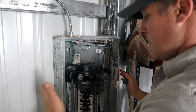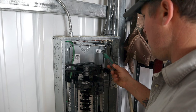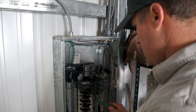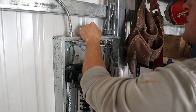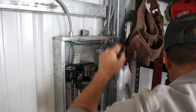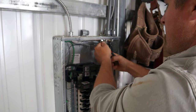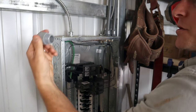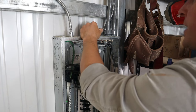So we got the panel cover off and the power turned off at our main box. We're just going to test it now to make sure we have no power in this at all. Appears we are good. I want my conduit running up about right here so it clears this little beam. These little pieces in here — you can get some pliers and just punch them out with a hammer or twist them with a screwdriver. These little covers come out and then you can slide your corresponding coupler right into the top and secure it to your panel.